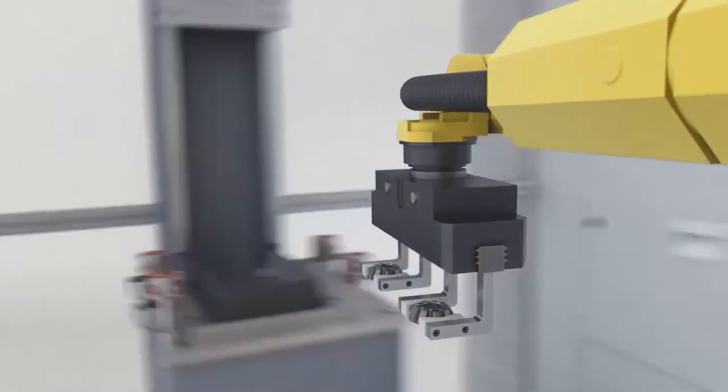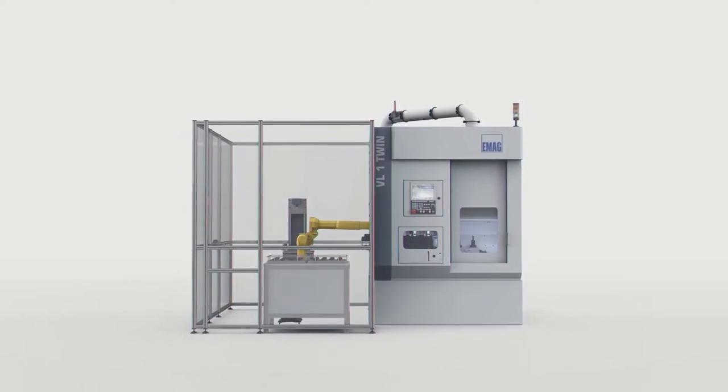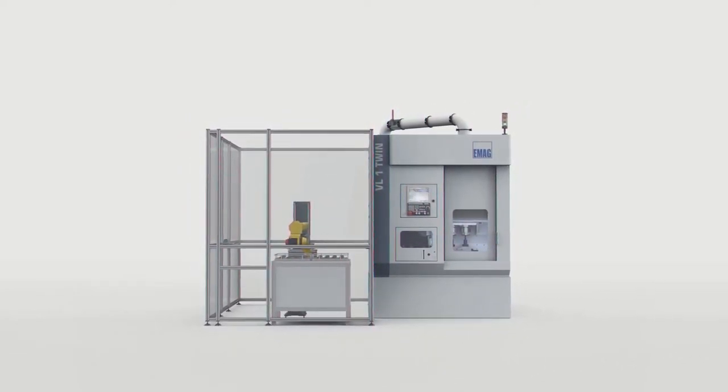As illustrated, robot time required is about 11 seconds. So if my load/unload time at the machine between the swivel table and spindles is five seconds, that allows machining time down to six seconds. If we are machining at six seconds and loading/unloading at five for an 11-second takt time, that gives you a component every five and a half seconds. Outside of automotive, many other industries have high-volume components where this type of machine definitely has a place.